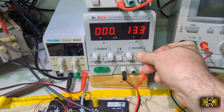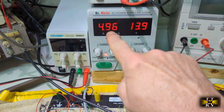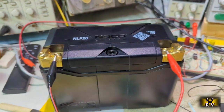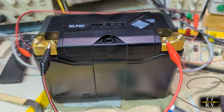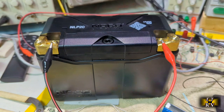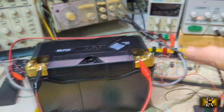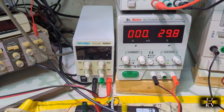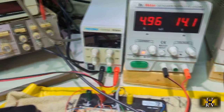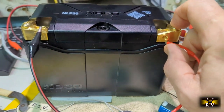Here's the power supply. I can increase the voltage and you see the current rising and the voltage increasing, sending energy from the cable into the battery and charging it. If I try to go beyond 14 volts, you can see what's happening — it's not letting me. If I undo this connection, you can see that's 25.98 volts from the supply. But when I connect it to the battery, it limits it so it won't go above that voltage and current. The internal electronics is preventing over-voltage and over-current on the charge.